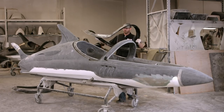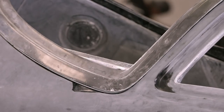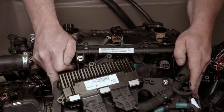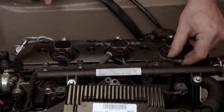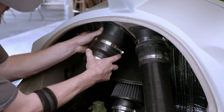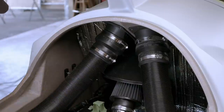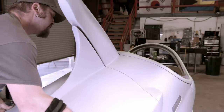Next, the fit of the hatch frame in the rim around the cockpit is checked. This will be bonded into position later with liquid plastic and putty. After the surface of the craft has been primed ready for its final coat of paint, it's time to fit the powerful engine into the back — this is a dry fit to confirm everything lines up correctly. Next to be connected are the air tubes to the snorkel fins that deliver air to the engine. The engine hatch has also been primed, fitted to the watercraft's main body, and locked in position.